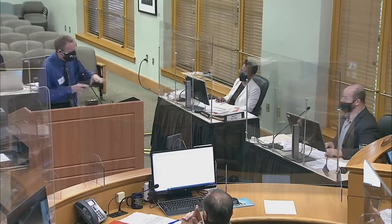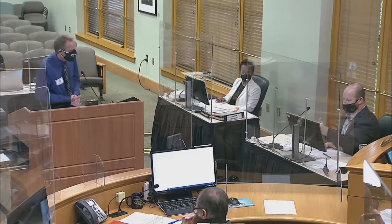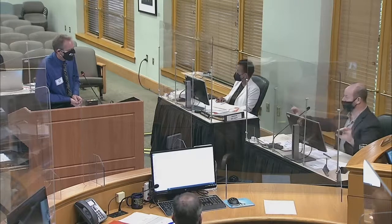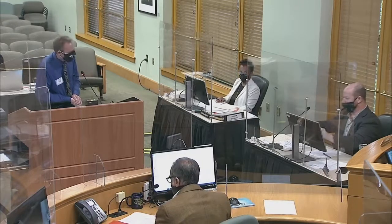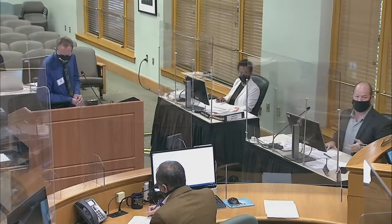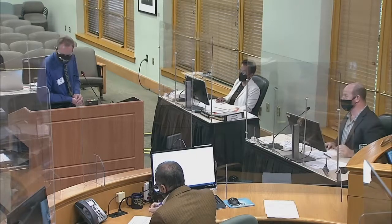I'm sorry, like a pier? Yeah, because typically these types of houses would have piers supporting the structure, and then you'd run the framing off of there, but you just need to break up that long linear stem wall at the bottom. I'd put a pier at the end and a couple, just to break it up, and stucco in between the brick pilasters would be an appropriate historic treatment.